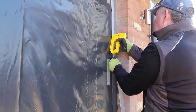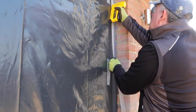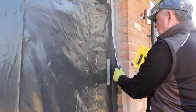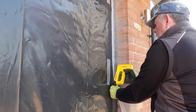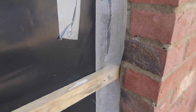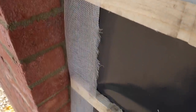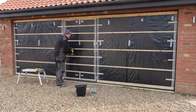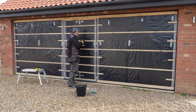Around both the perimeter and the central door opening, I stapled insect netting to the ply before fixing the treated 35 by 20 battens. Once the battens are fixed, I can fold the netting back over onto them and staple them, thus ending up with a creepy crawly free air gap. I simply screwed the battens horizontally to the wall at around 500 centres and at 250 centres around the door and the perimeter, just to help fix the insect netting and give the perimeter a little bit more strength.